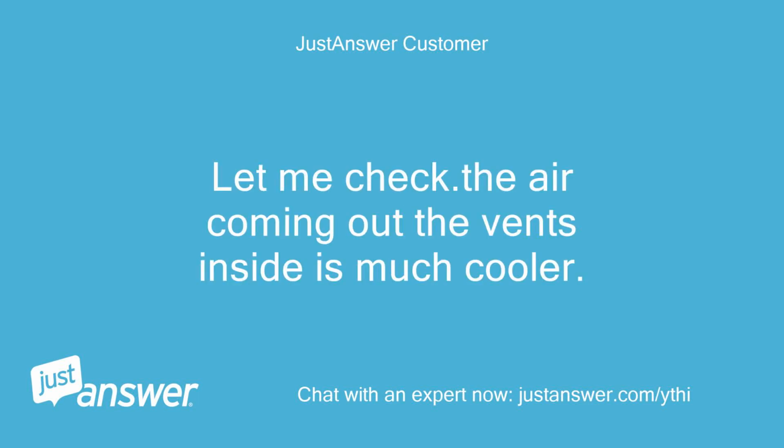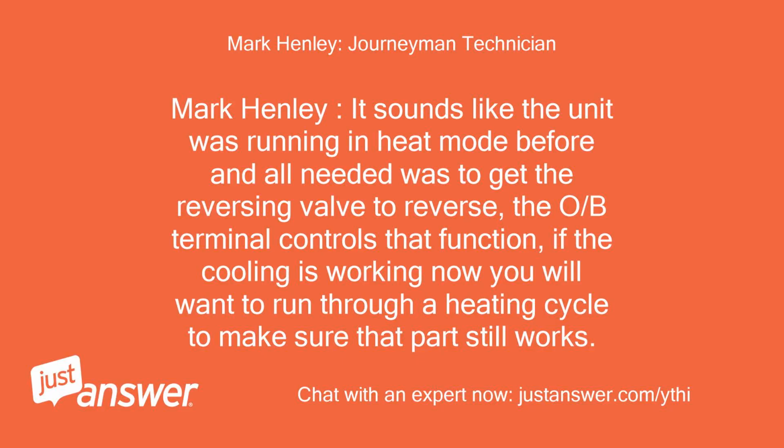Let me check. The air coming out the vents inside is much cooler. Mark Henley, it sounds like the unit was running in heat mode before and all needed was to get the reversing valve to reverse. The O/B terminal controls that function. If the cooling is working now, you will want to run through a heating cycle to make sure that part still works.